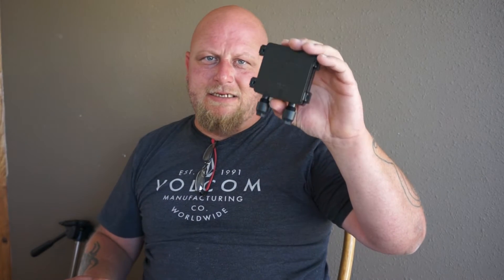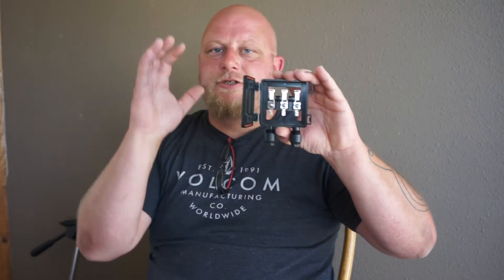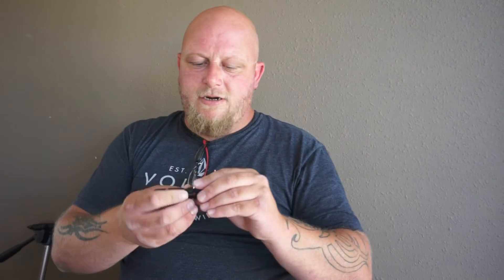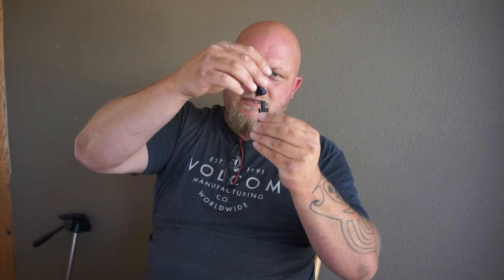You're also going to need a junction box. You don't have to have one, but I like it — it makes it look more professional and it's easier to work with. This will come off the back of your panel. You'll run your wires into the back, and then you'll have two wires coming out connected with MC4 wire connectors. So you'll have your wire connected to this that goes in the back, another wire going into your battery box, and you just clip them together.